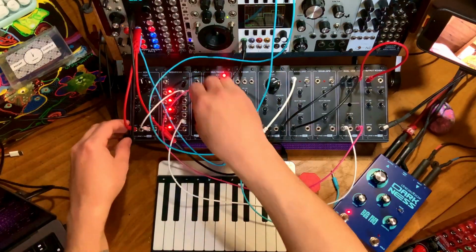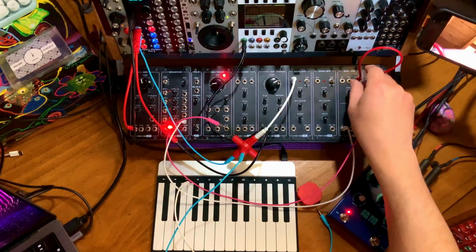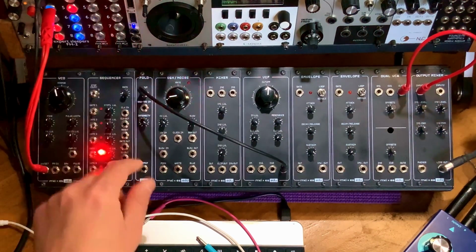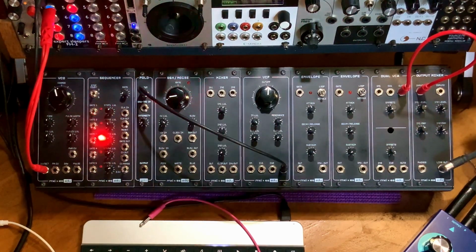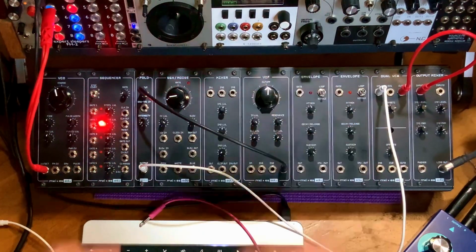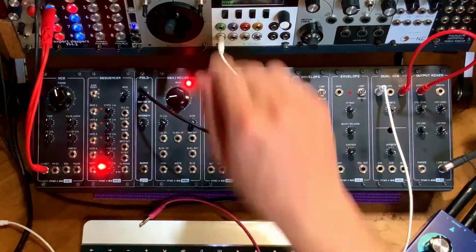The filter generates a sinusoidal wave, so why don't we use the filter? Let's undo all this patching here and do some experiments from scratch now. Let's put the filter resonance high, and we'll plug the output of the filter into the input of the folder. And now we're using the regular input, not the saw tri input. And let's plug that straight into the VCA here and manually turn it up. Alright, but I still want to look at it. We'll use the scope.